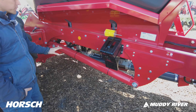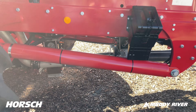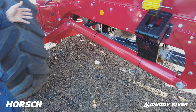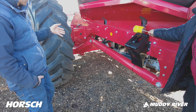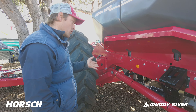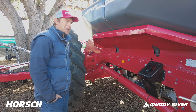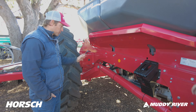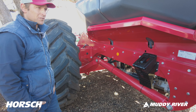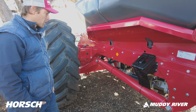This is set up very similar to our machine. The difference is we're on 10-inch spacing and it's also running half-width shutoff, integrated with Greenstar. We used half-width shutoff and variable rate on our fertilizer this year — going anywhere from 25 to 50 kilos on the starter — and also using it on point runs. At $1,500 a tonne, you want to be saving a bit. Works very, very well, very simple. And if you decide to put it on at a later date you can — it's all ready to go, very easy to install.